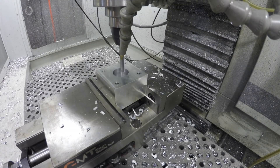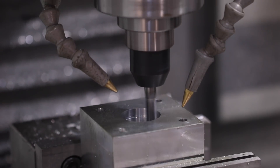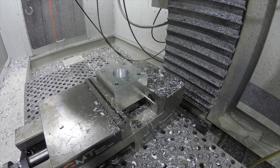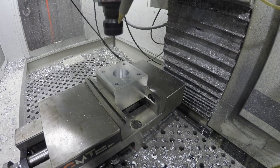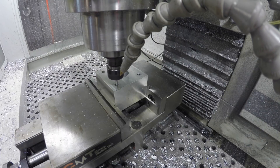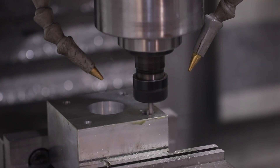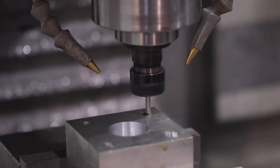Tool 100 — 3/8 inch two-flute carbide end mill, 5100 RPM, 12 inches a minute. Then we'll cut out those counterbores for the socket head cap screws with the 3/16 two-flute carbide end mill, 5100 RPM and 9 inches a minute. Two depth-of-cut passes — still makes pretty quick work of it.